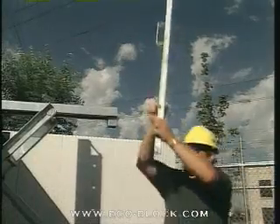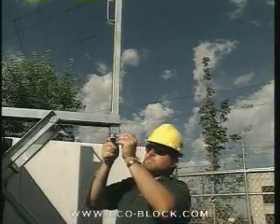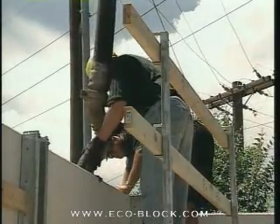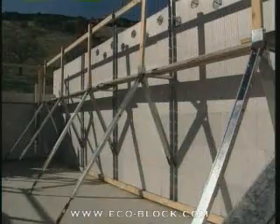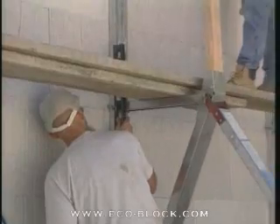Finish assembling the frame by setting and pinning the balusters, then placing the walk boards. The balusters have brackets for 2 by 4 handrails. If the walk boards are 8 feet or more off the ground, OSHA requires the use of handrails and toe boards. With the system complete, go back around and adjust the turnbuckles so that the uprights are plumb.